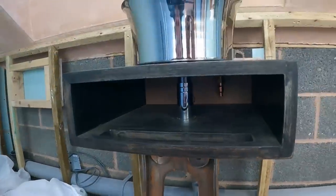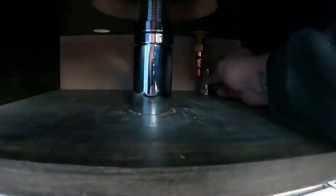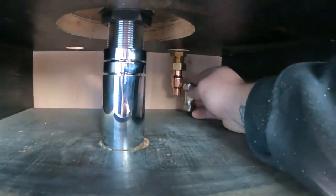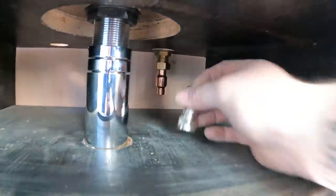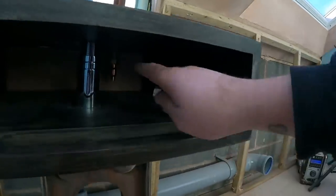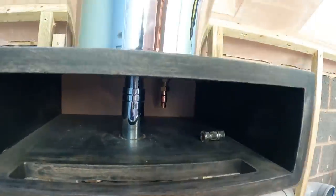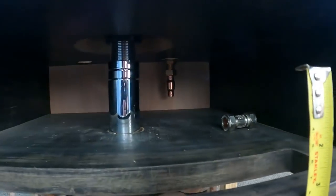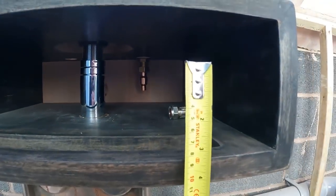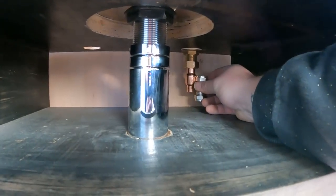But to go from chrome, this is why I needed to get an isolation valve in here really, but we're not going to have the depth unless they do a 3/4. Drop a comment below if you think you know what we can put onto that. A 22mm, 3/4 thread, we've basically got, by the time we've connected into that, we're probably going to have 3 inches to get an isolation fitting in. It's going to be tight.